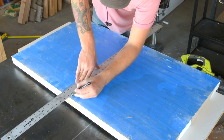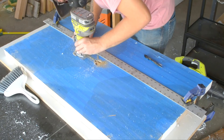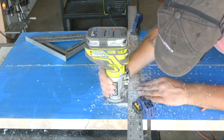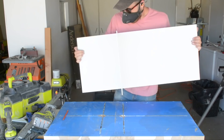I'm pretty confident if you just set the tabletop on the base it would be sturdy enough, but I decided to recess the base into the tabletop about a quarter of an inch. By clamping a straight edge and using a quarter inch double flute straight bit in my palm router, I was able to make a groove that the base sets into. After routing the groove and putting my base in place, I realized I had lined it up on the center mark rather than the third mark like my base was made — so I had to reroute that groove. It's no biggie since this is a low coffee table and no one will ever see that extra groove.